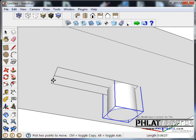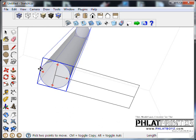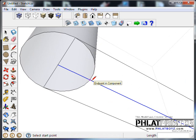But you'll notice if I use this line and I go all the way over to where the center of the bit would be, stopping on that line, like right here, our hole becomes bigger because we never took into account half of the bit's width. So we have to think about that and basically make sure that our line is pulled back half of the bit's width. If I select a line from here to here, look down in the length, you can see it says it's basically a 32nd.